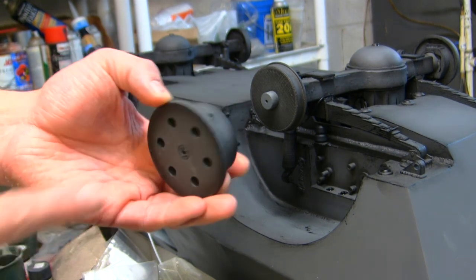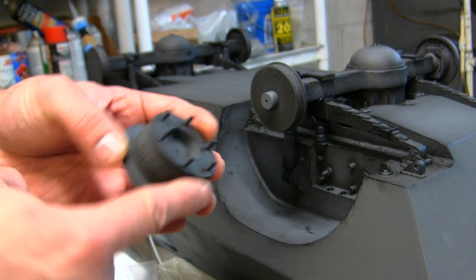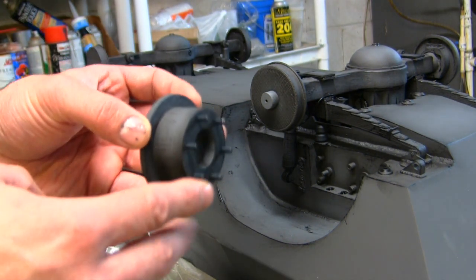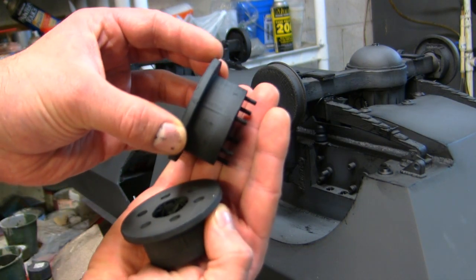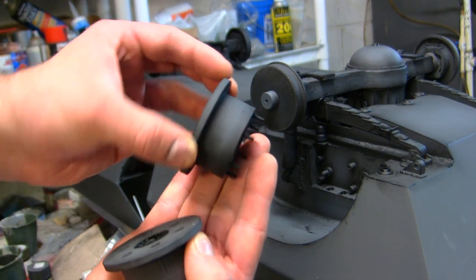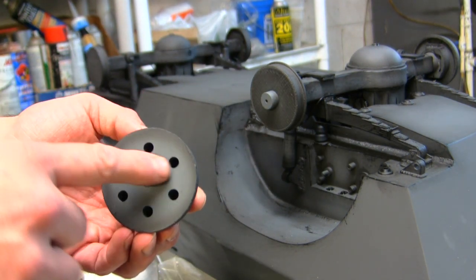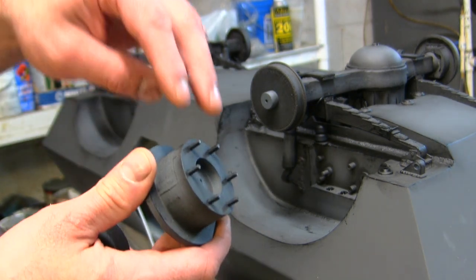With this method, you just literally screw the bolts directly in place until they bottom out. Since it's 3D printed, the bottom shelves are completely uniform, and thus, once you're done with the fasteners, they should all have the exact same height. Once they are threaded in place, a drop of super glue is added to each of them just to keep them from loosening up, specifically when it comes time for the mounting of the nuts.